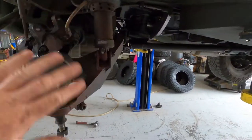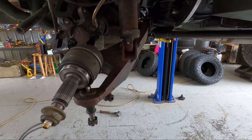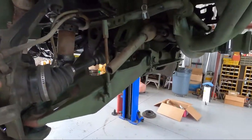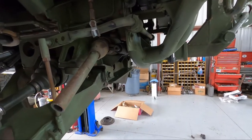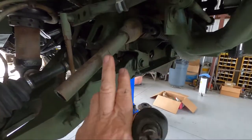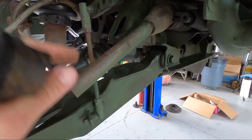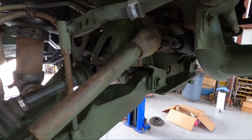I have this whole wheel hub assembly off because I had to pull it off to fix something else, and it's also going to give me more room to do the airbag. On the other side I just pulled the wheel off and left everything else. I also pulled the tie rod ends off both sides. I don't need the old tie rod tube for the new unit because the new one hooks up differently — it's got a heim joint that goes in and pins.